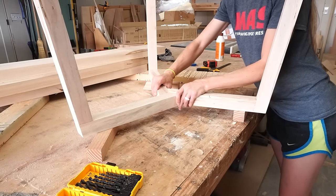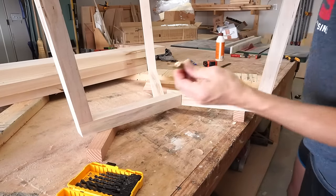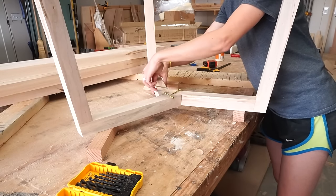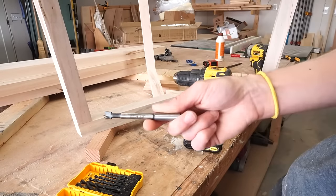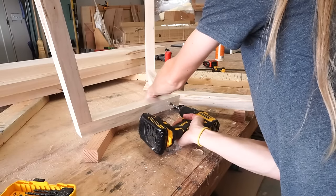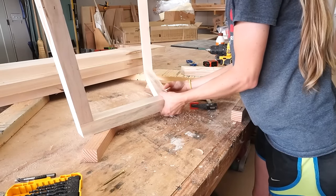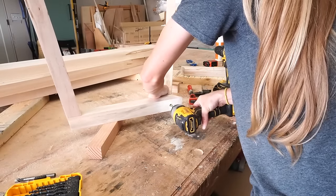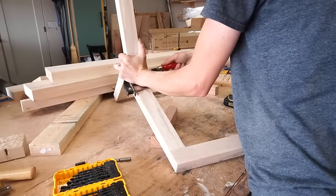To assemble these pieces in the middle I used screws — one through each of the three joints — and then used dowels to plug those screw holes. I used a Forstner bit to drill out a hole to plug once the screw is in, pre-drilled the hole, then drove a two-and-a-half-inch screw to attach. I used a generous amount of wood glue at each joint, and once all three screws were in I plugged these holes with 3/8-inch dowels.